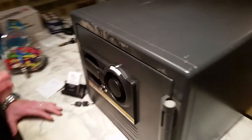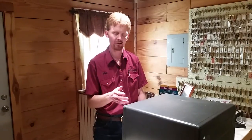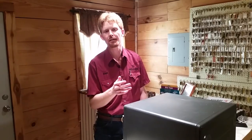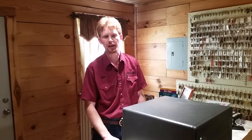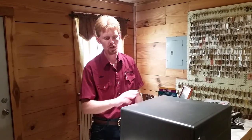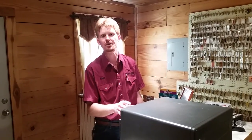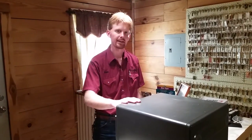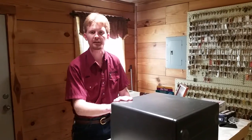So that's all there is to it. On a four-wheel Sentry Safe with a four-number combination mechanical lock, you go four to the left, three to the right, two to the left, and stop on your first pass for your final number. This is true for all four-wheel Sentry mechanical combination locks universally — it doesn't just apply to this S-series safe. Any four-wheel or four-numbered Sentry safe, this dialing technique will work.